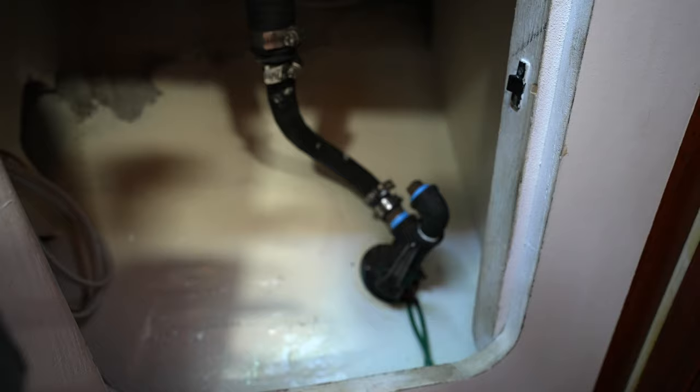And then once you clean that off and you put the grease on and you put the seacock back in, it should be an identical mate. And then you'll be able to tighten it down to the point where you can work the thing and it shouldn't leak. Let's lap this son of a gun.